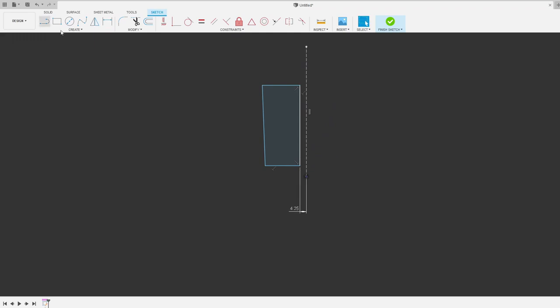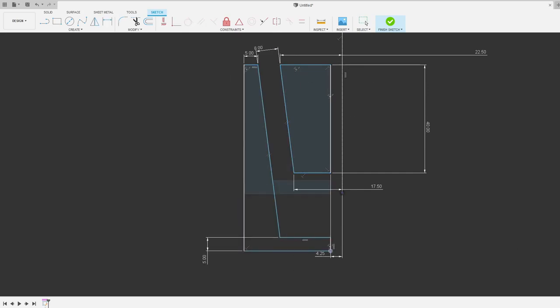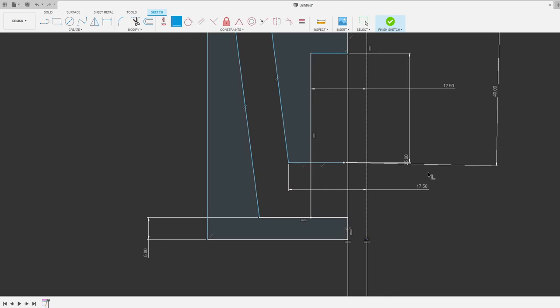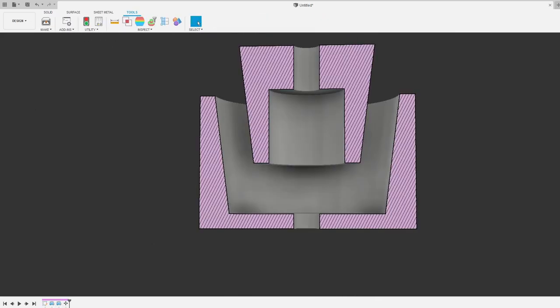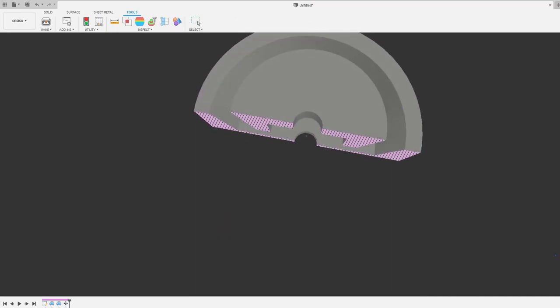I'm using Fusion 360 here and the mold is made up of just two revolved shapes. One is the plug which will go down the center and the other is the tub which everything sits in. There is a hole down the center for an 8mm threaded rod which will be the backbone of this particular mold, keeping the two parts aligned and together.